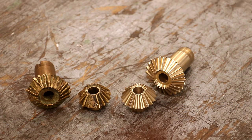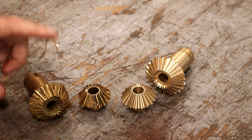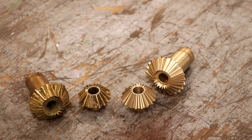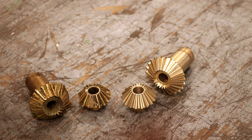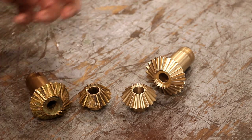Up first, I've got some parts for my metal planer I want to share. If you've been following my metal planer restoration, you probably remember when we took some pretty nasty-looking bevel gears out of that machine. At the time, that was a pretty major setback because I knew getting new bevel gears made was going to be a big deal. I have made a bevel gear before — I had a video on that — but for this particular pitch, I talked about the difficulties of making bevel gears on a dividing head on a horizontal mill versus getting a true involute on a gear shaper. You can get the job done, but there are better ways.